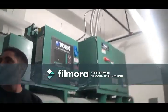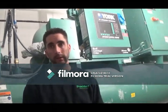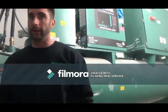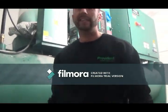Yep. So you rotate system water, hot water, and condenser water pumps. That right? No, you've never gone over the condenser. Whether that got auto figured out or not, we'll see. The chiller guy should have had a lead lag controller installed, but we'll have to figure that out.